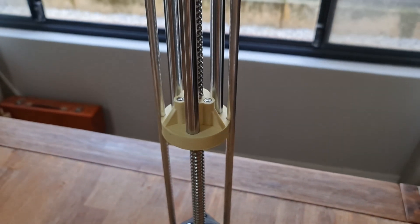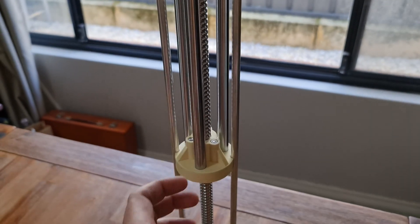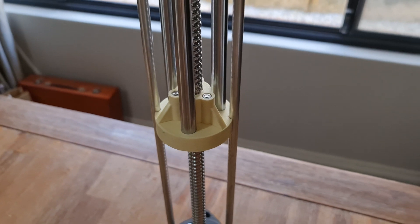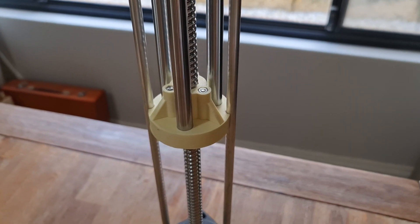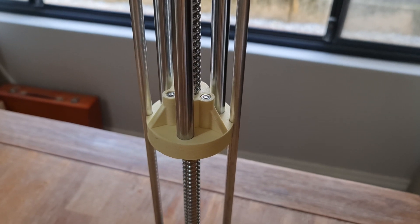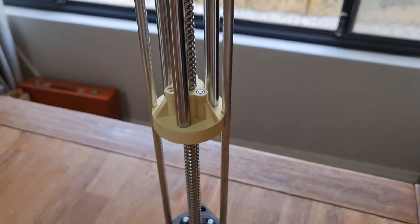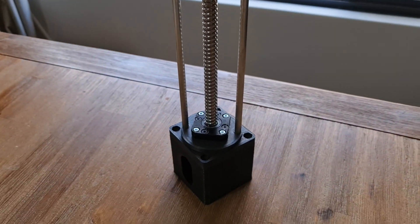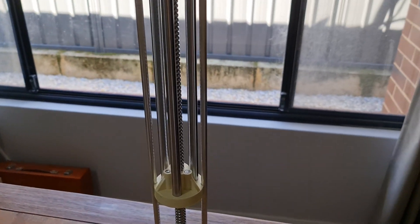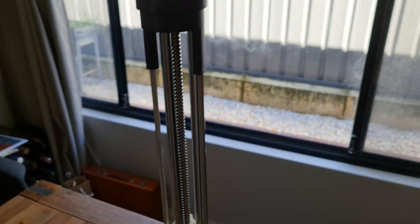The last design didn't have the sliders and it was getting some rotation on direction changes, which is not ideal — it's probably going to put strain on this 3D printed part every time and it's just going to fail. So I've gone back to the clamping system that I've always used.